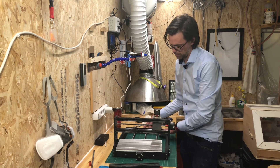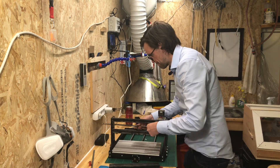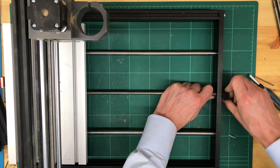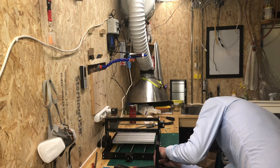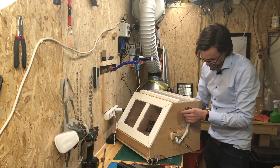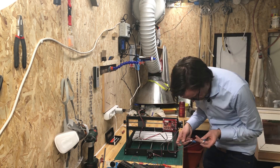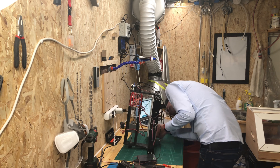The positioning of the table isn't done yet though — it will be properly squared later on. I did give it my best at this point, but luckily I had better luck after it was all assembled and connected. I also removed the X-axis lead screw, as I was to replace it with one a bit longer to accommodate an adjustment knob at the end of it, like the one on the Y-axis lead screw. The coupler is replaced as well of course. I then position the table of the CNC and the X-axis gantry, making sure the end of the router motor will be as centered on the table as possible. Then I detached the controller board from my enclosure and mounted it temporarily to the X-axis gantry and connected the wires in order to be operational again.